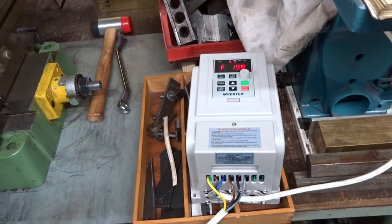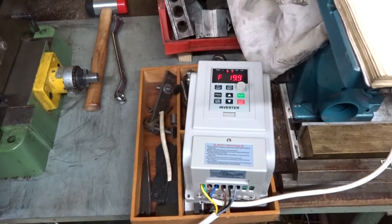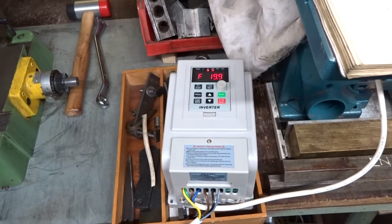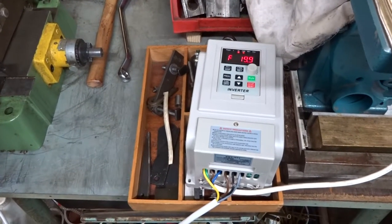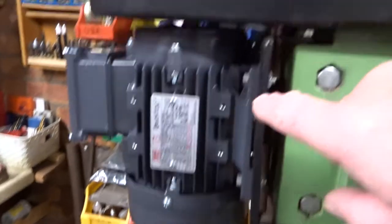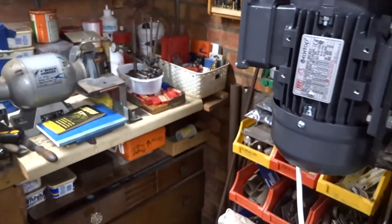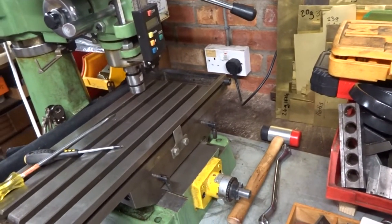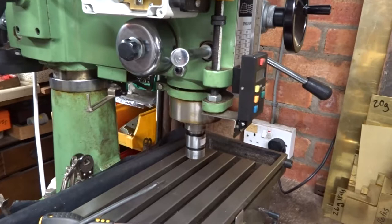According to some earlier tests I carried out using my rather unreliable, I have to say, Chinese digital speed recording instrument, tachometer, a frequency of about 20 set on the inverter gave a spindle speed on the motor of about 595 rpm. So what I'm going to do is press run, and because it had already been set to 20, the spindle on the milling machine is going round,